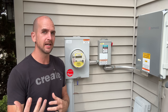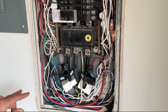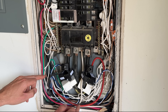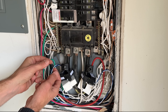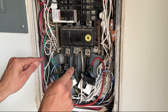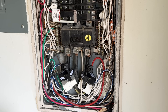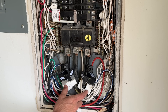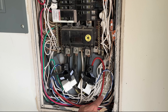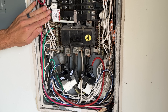Let's look at the panel and how we actually land those wires in. What we're using is called a line-side tap, though there is another option. For the solar connection, the black and red wires coming from the Envoy through the main disconnect go into clamps that clamp onto the main lines — the two phases coming in — and pierce into the copper. That's how we make connection, bringing solar power into the line side. The two black current clamps are from the Enphase Envoy for tracking overall in and out.